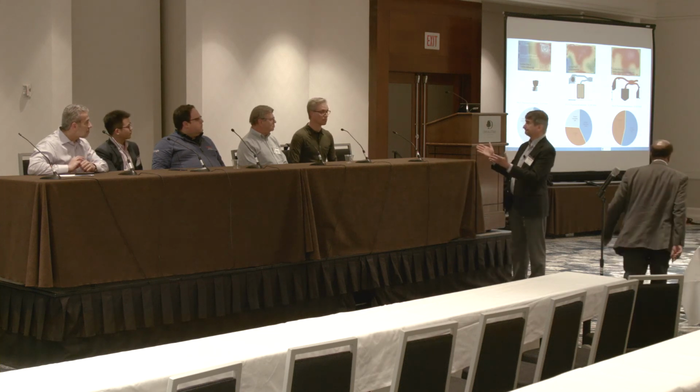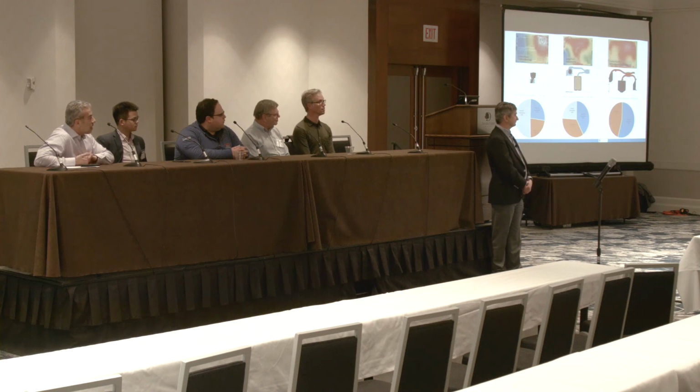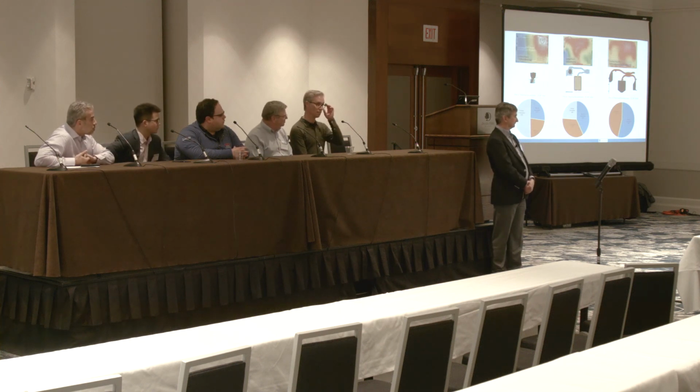Thank you. Anyone? Many phones have POP packages, so the memory is on top of the processor. I think that's the first level. But now he's asking, are we going to go further? Are we going to stack memory die a number deep? Just get 3D. So I think from his point of view, miniaturization is a great advantage doing that. But thermal stuff is very complex. Then you're trapping the heat in between the layers. And modeling that stuff is extremely difficult, I guess. There's no solution even at the high end, right? So I'm just curious, is there any thought process at all?